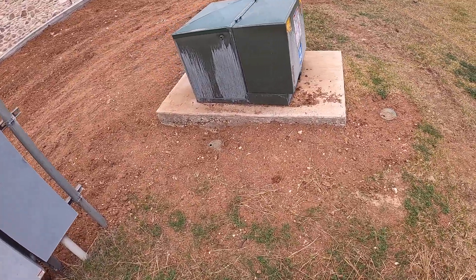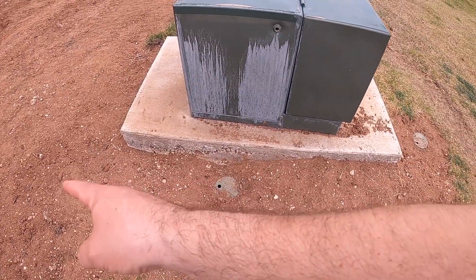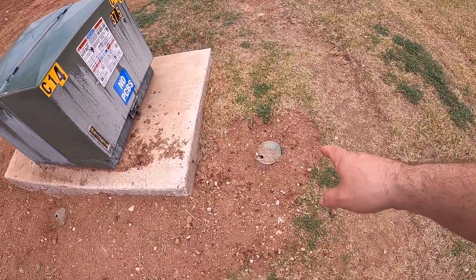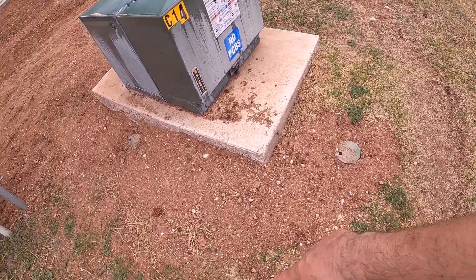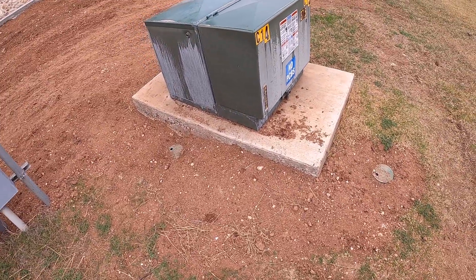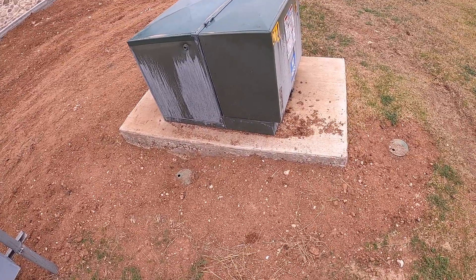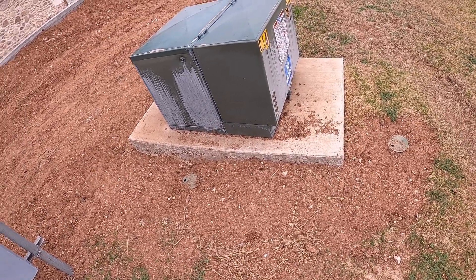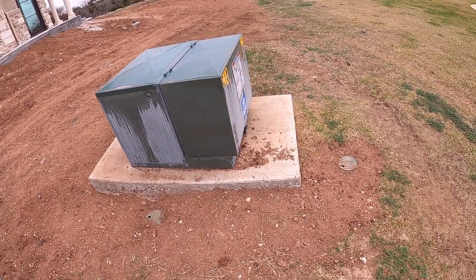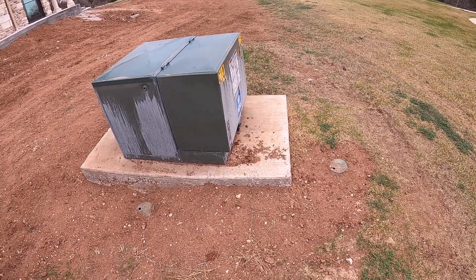All the pipes are buried in now. Got a cap here for the shutoff valve — that one-inch line that goes across to this nearby structure — and here's the cap for that other main house line. That elbow is underneath here where we added that piece. Got it all buried in, don't seem to have any leaks, pushed the air out of the system, everything seems good. Tapping into a main water line like that isn't too bad if you use that little trick with the elbows to give yourself some room to work and a way to bridge across and put your splice in the middle.